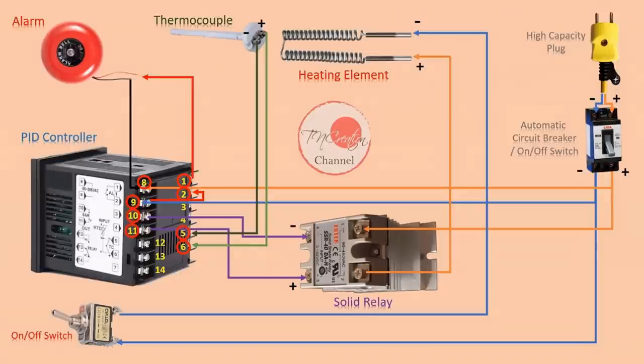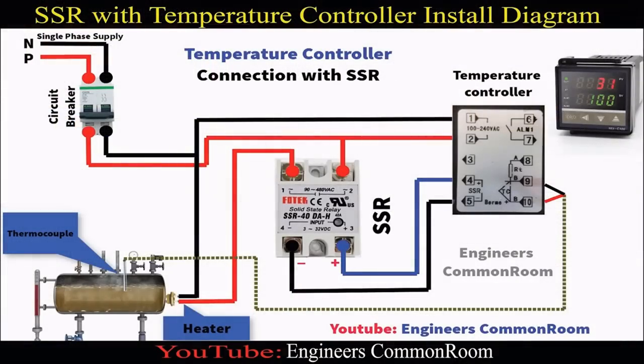If you ever want to wire something like that together, I've done videos on how to wire together kilns, but normally PID controllers come with a pretty little picture on the side of the controller telling you which bit screws into which bit. So practically, all you're actually doing is screwing the right connections together and making sure that your temperature sensor is on your heating unit.